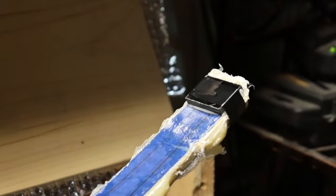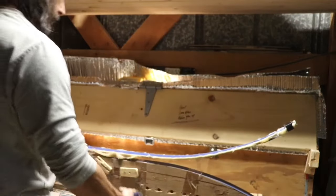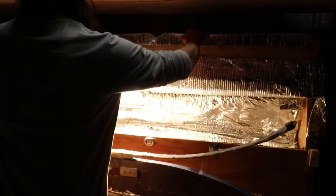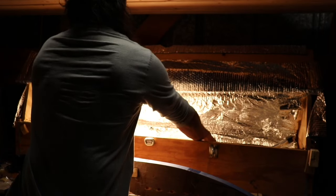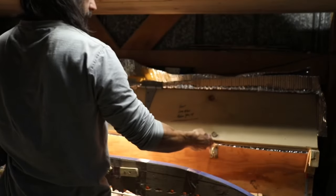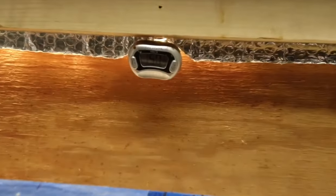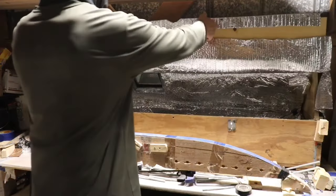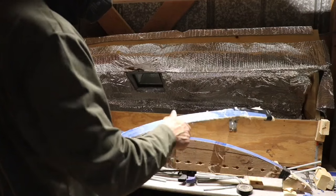When you put the tape on, make sure it didn't shift on you due to the squeeze-out. Clean that off, do the other side, and then you're ready to put the bow in the box. I like to set my bow on a block of wood in the center so it's resting without touching anything. You want it to be right around 150 degrees — somewhere between 150 and 165°F is great. About six to eight hours later, shut it off. I usually let it sit overnight — shut off the box after about seven hours of heating and let it cool on its own for close to 12 hours.